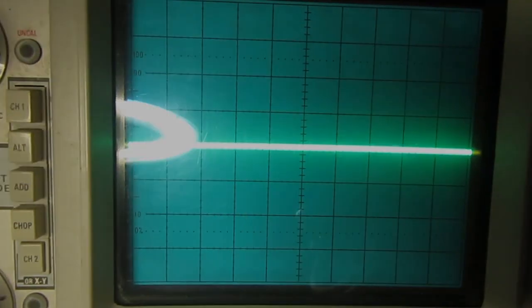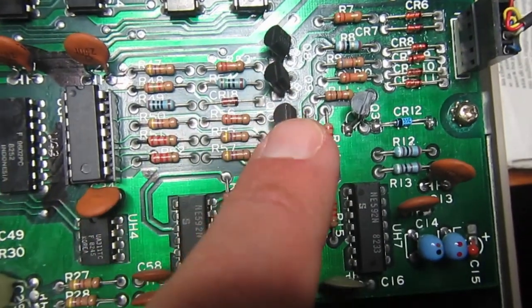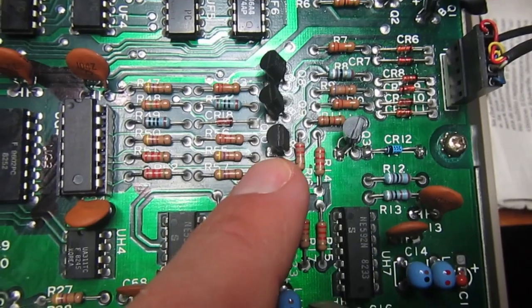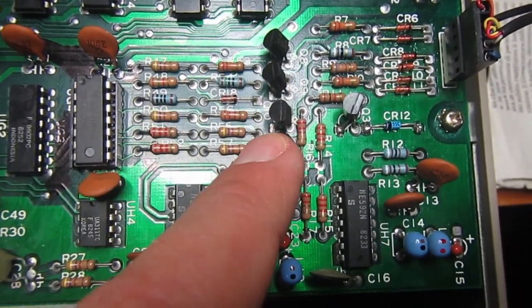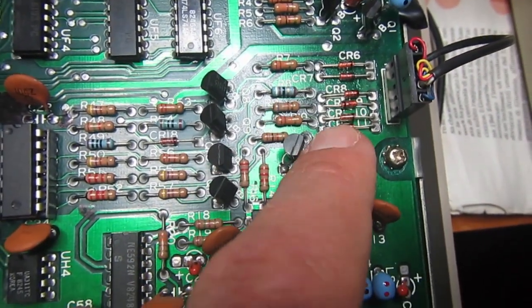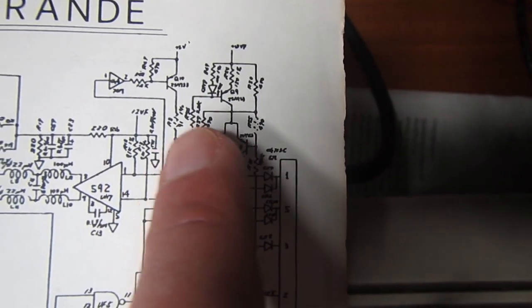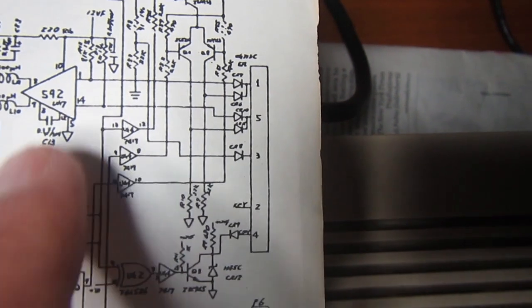Then why do we have this signal here? This is the problem now. Okay, there is nothing wrong I can find. I checked these transistors at the beginning of the troubleshooting. They all seem fine. Also these diodes are okay. And we are seeing these diodes in the schematics, these transistors. This is part of the write circuit,